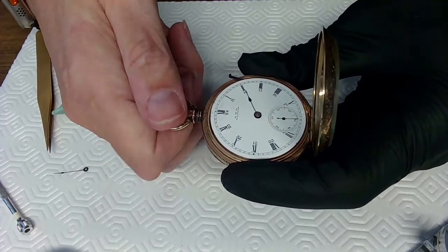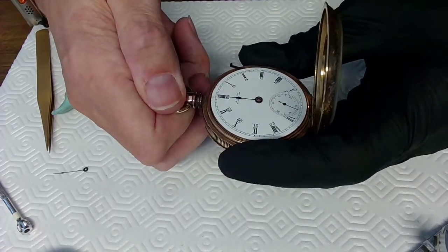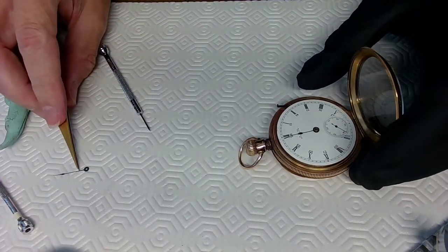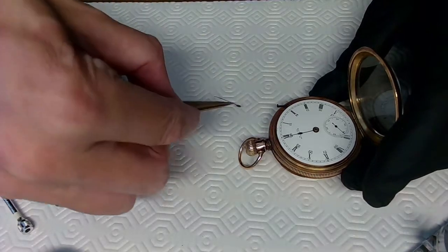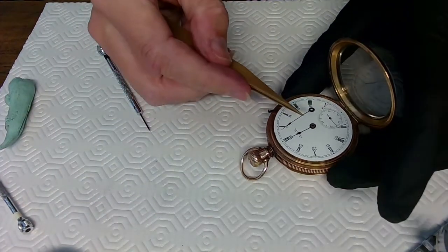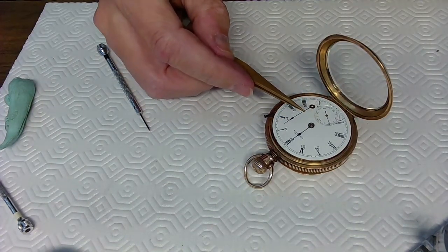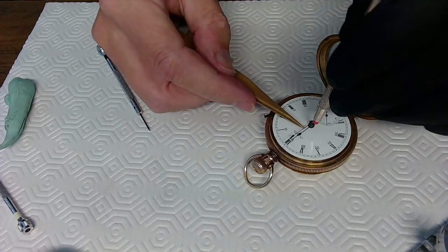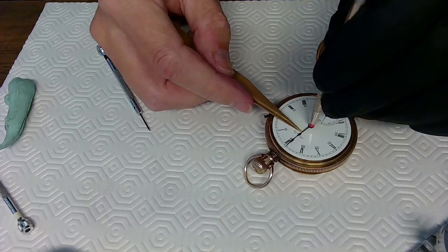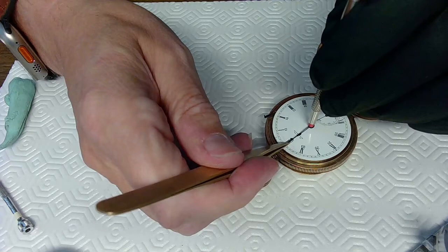The whole movement seems to time better when you move it backwards, even though I don't like moving a pocket watch movement backwards. So let's press on the minute hand here. So there's the minute hand, and I'll just press that on top. It's aligned at 12, so I just get it as close as possible to 12. Realizing these are old watches, sometimes in this world, maybe close enough, right? So just put a little bit of pressure on it,